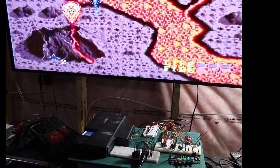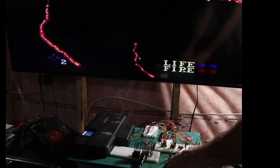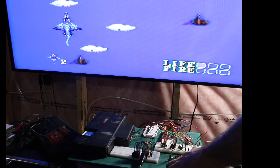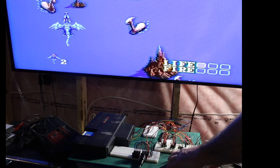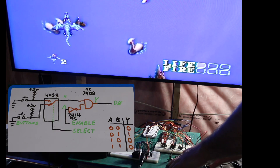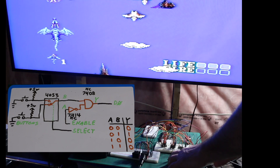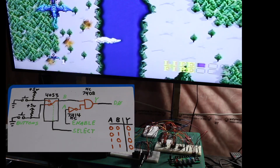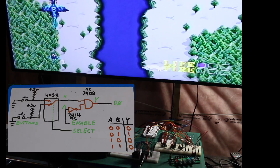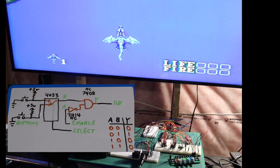Now I have the circuit hooked up. I don't remember which button is which and I don't have all controller buttons enabled, but I'm looking for the run button — I think that's it — so I'm starting a game. I can move up, I can shoot, two different fire buttons. I can pause and re-enable. Now that I have this circuit working, once I get the real chip to replace the makeshift logic circuit, I'll retest and make sure it's all good. Then I know I can electrically control the button inputs for a TurboGrafx-16 controller and can work on incorporating that into the ongoing project of turning a PS4 Bluetooth controller into a retro game interface.